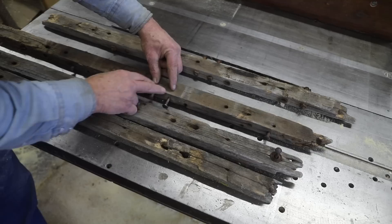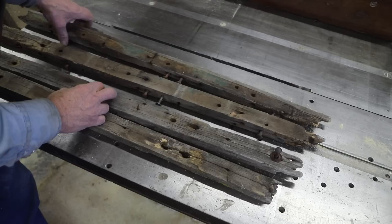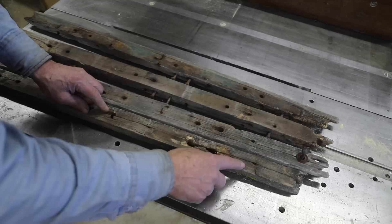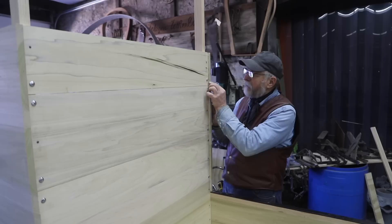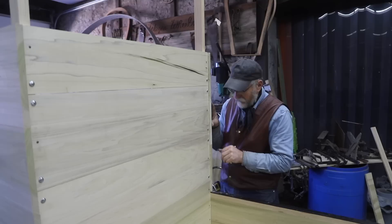There's evidence of nails at multiple points — on the rear joints we have a double joint for the side boards and a double joint for the end boards, and there's evidence of a nail there too. So there's enough indication that they did do that. Plus I wanted to do it to prevent warpage on such a wide board — these are all 11-inch area boards. A nail in the center is going to help prevent warping. I left these side boards a little proud — a little strong in length — they overhang about a strong eighth of an inch, almost three-sixteenths. I'll take a quarter-inch roundover bit and just take the sharp corners off these edges. I wanted to disguise the heads of these carriage bolts a little bit as we look directly on the side — it doesn't completely hide them, but just takes away from that true square corner.